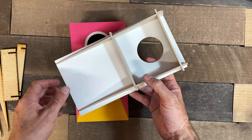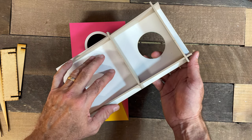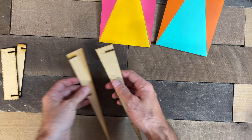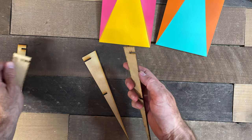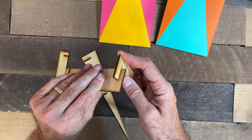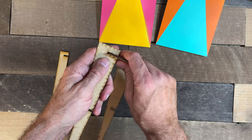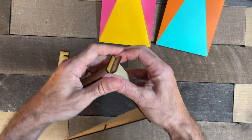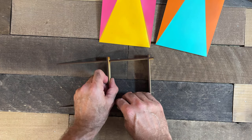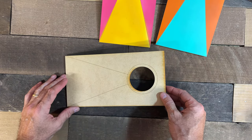So it's pretty straightforward. You just got two of the rectangles here for the tops, and then on the bottom side, you've got four pieces that slot together, and then you glue it to the base, and you're all done. You've got some triangle pieces here, and you take these two rectangles and you just slot them together. This is the part that you're going to edit for your material to make sure it fits the way you want. I've got it fitting very tightly because that's the way I prefer these projects to work. You'll measure your materials with your calipers and then adjust these if needed based on the thickness of your material. So this should go together just like that, and then you'll take the top piece and glue it just like that.